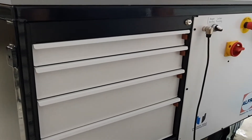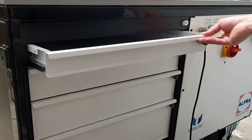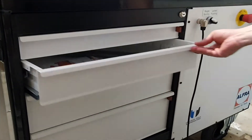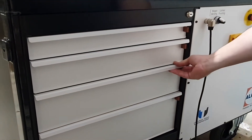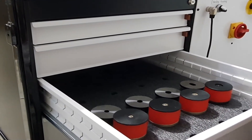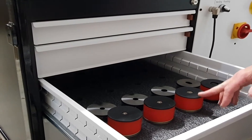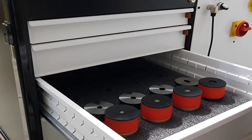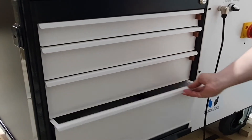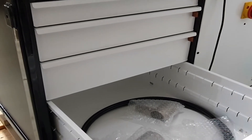On this side of the machine we've got four drawers so you can put tooling in there. We've got accessories. This drawer here is where all your punch and dies are kept — 9mm, 11mm, 13.5mm. We also do oblong for fish plates. And finally in the bottom drawer, hydraulic hoses, and you can put your foot switch in there as well.